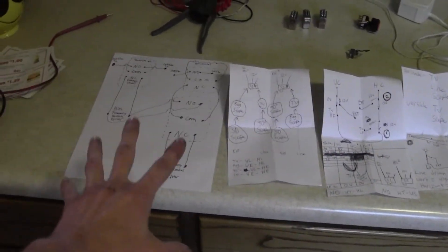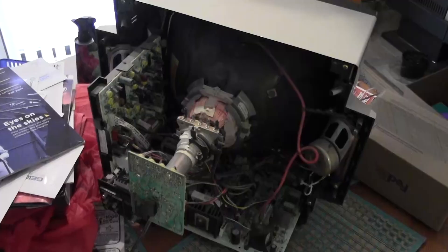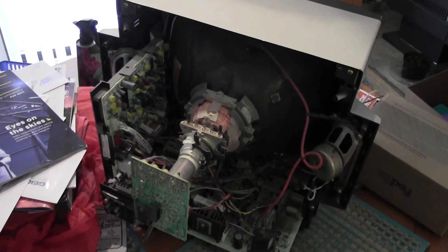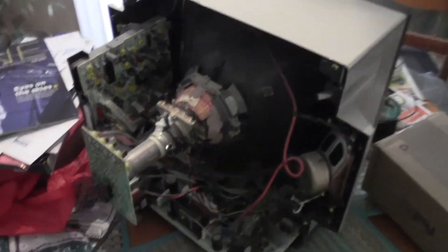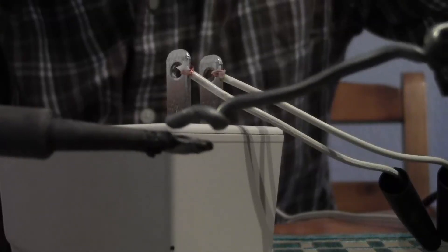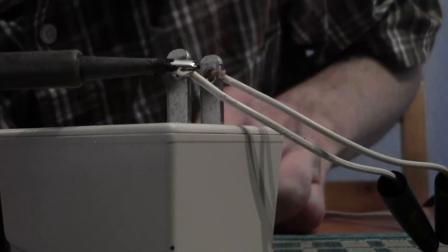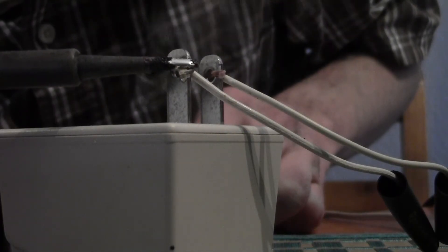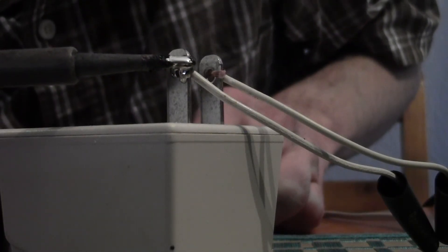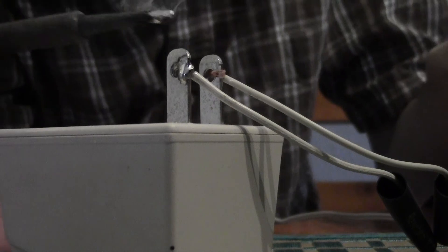At the end of the video I will show you the wiring diagrams. Cathode ray tube televisions are incredibly dangerous and can kill you, so attempt this project at your own risk. First, we'll need some wires to power our 9-volt power supply for firing the relays. Solder two wires onto the plug of the power supply — use acid flux or plumbing flux if you have it, as it will work much better than electrical flux.